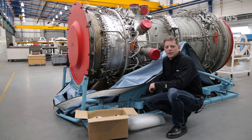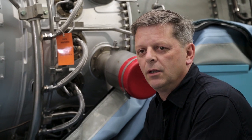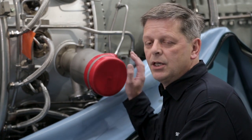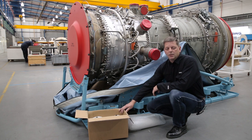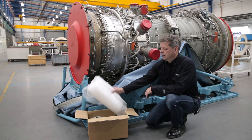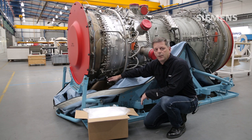At this point in the dispatch process we look at the matter of loose items. Quite often these have been found loose and unprotected in the MVP bag, which has the potential to cause damage to the component as well as the MVP bag itself. In the case of the HP bleed valve, were it to be removed, we would expect it to be packaged both to protect it and the MVP bag. Once packaged, the item is best stowed in the rear of the engine. This applies to any other loose items as well — they should be suitably packaged and safely stored in the rear of the MVP bag.